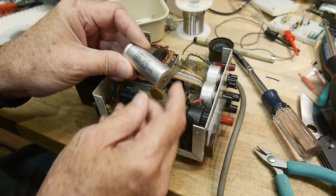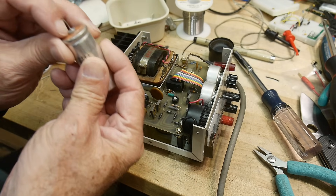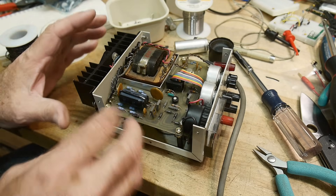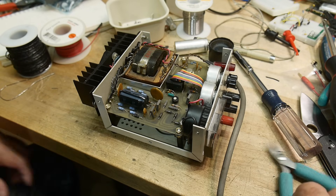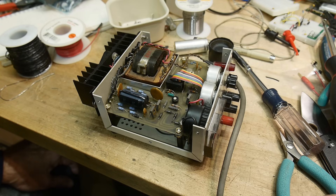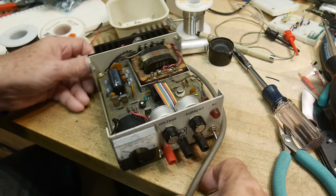This is a nice capacitor - look at the size of it: 650 microfarads at 75 volts. It would be hard to replace with anything better. I put equivalent replacements in just to see if it works, and if I got it working I'd buy nicer caps. But when I got it all recapped and turned it on, it had the same symptoms as before. Then I turned it on a second time and it made high-voltage arcing sounds - not good. Then it blew the fuse.